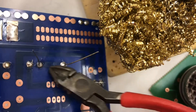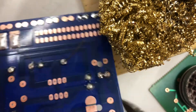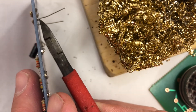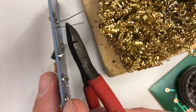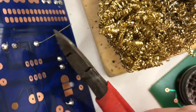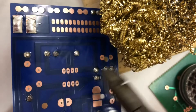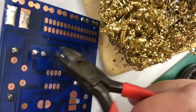We just finished our resistors and have our Hershey's kiss shape. Now we're going to get these leads off so it's not dangerous and won't short out. We'll use angle cutters — note the angle of the cutting edges so your fingers stay off the board. Turn it sideways, try to cut a little bit of solder off with the lead, set it up so fingers don't get scraped, and push down to cut as close as possible. If done right it won't look like a cactus — see that one looks like a cactus. Push down flat and it's perfectly flat and not sharp anymore.